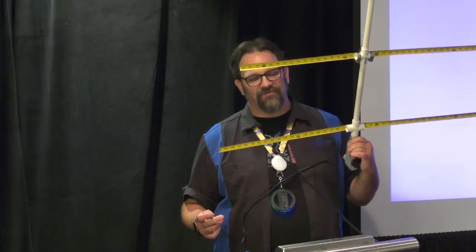Where you're going to run into problems is, let's see here, let me do the math in my head. If there's a signal on 154, right? The difference of 154 and my local oscillator goes down to 150. The sum of the transmitter I'm hunting on, 146, and my 4 megahertz oscillator goes up to 150. So you've got a dual image problem there. You will hear signals that are both on 154 or 146 on the input. So yeah, that is a problem. I've never run into that problem, but conceivably it could be.